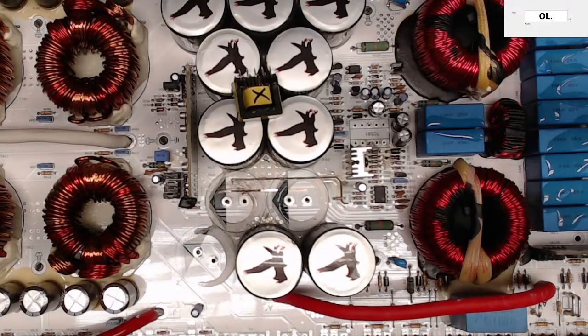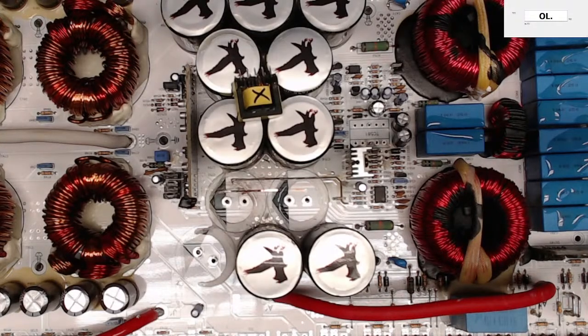Again, please, if you charge up your amplifiers, make sure that you discharge those rails if there's no discharge resistors on the board. Hint, hint, some of those type fours. Hey, Bass Ed, thanks for coming in. Yeah, especially on those type fours, watch out, because sometimes they do not have discharge resistors.